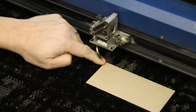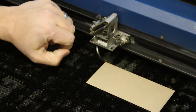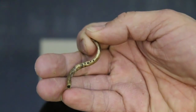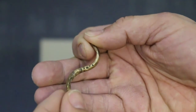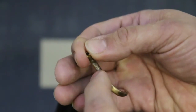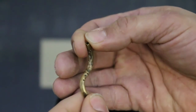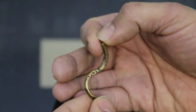This is just a pinpoint amount of air coming down to a point and it actually sprays debris everywhere instead of directing it away from the workpiece. Coming only in from one direction — not a great plan. One of our first enhancements was taking a brass tube and drilling some micro holes in it so as the air came out it would inject clean air towards the lens while also putting air down towards the workpiece. This proved not to be very satisfactory at all, so we had to take it to the next step and make something bigger and better.